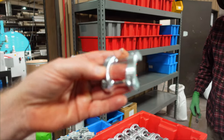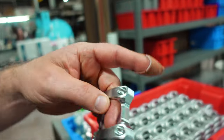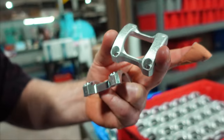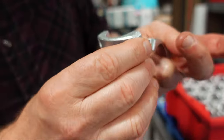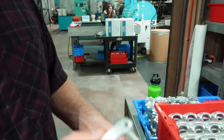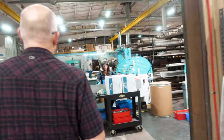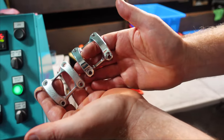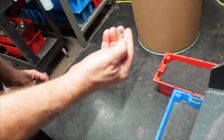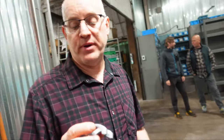So that's what a stem faceplate looks like when it first comes off the machine — nice finish, looks good, but you can see a couple little surface imperfections and maybe a little bit of a burr. So then you tumble it. In these machines they spin the parts really fast in individual containers so they don't beat against each other — it takes off just a little bit of metal and rounds the corners. Then it goes into this other machine and comes up to a mirror polish. That's all happening by spinning it in this media, which is basically a walnut shell with a polishing compound impregnated into it. It just spins at really high RPMs until it gets that surface.